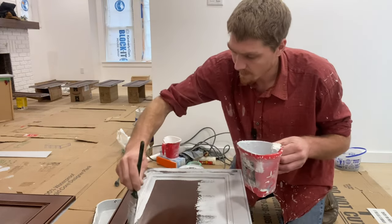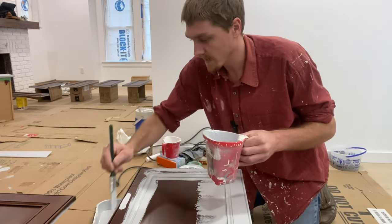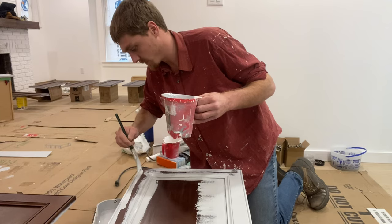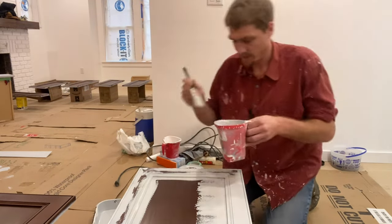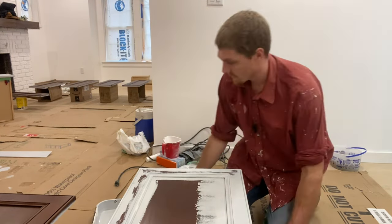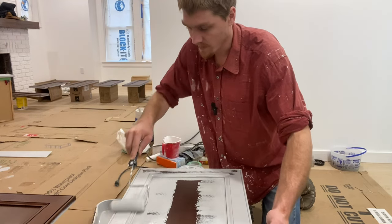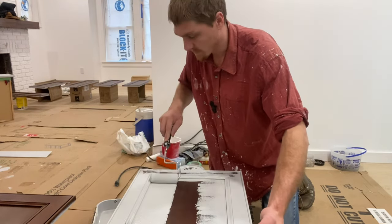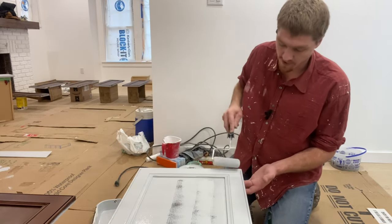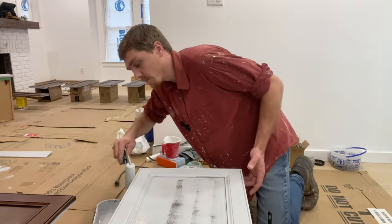I'm using a very cheap, almost disposable type brush. The reason for that is none of these brush marks are going to be seen — I'm only using it to get in the grooves. I really just didn't want to clean out a brush with this primer. You're supposed to use denatured alcohol for cleanup, which I could do, but for me it's more bother than it's worth with a primer like this — especially since I don't need a good brush. The brush marks are not going to be seen in any way, so I'm just rolling all those brush marks out before they dry on me.